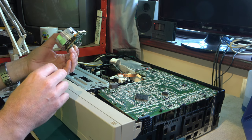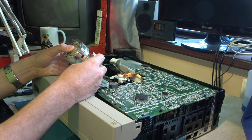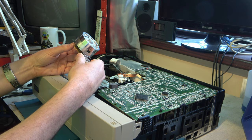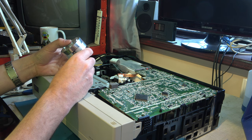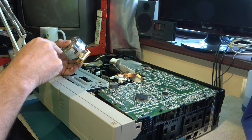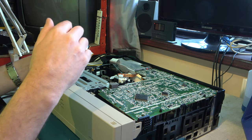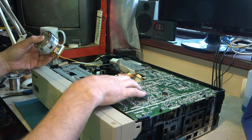I don't think this is going to be repairable. I don't need to since I have a scrap one. But it's just such an unusual fault. Thermally open circuiting one of the video heads. I mean, that is just absurdly weird. But it is right because the other machine that the other drum was fitted into is now run for, oh, must be about 20 hours of tape it's run, and it's absolutely fine, so it's definitely been fixed.